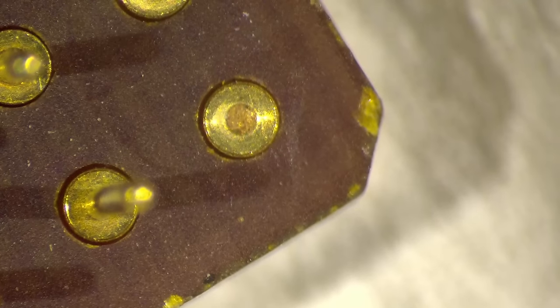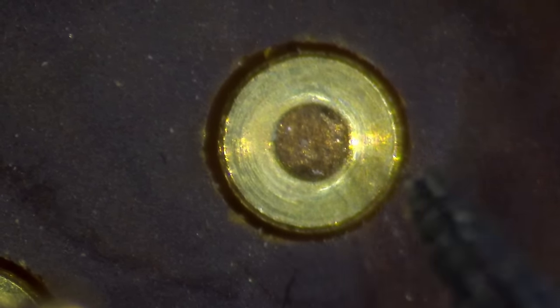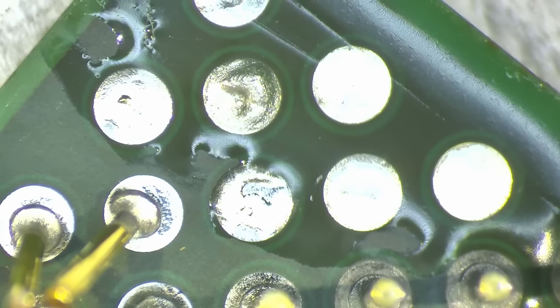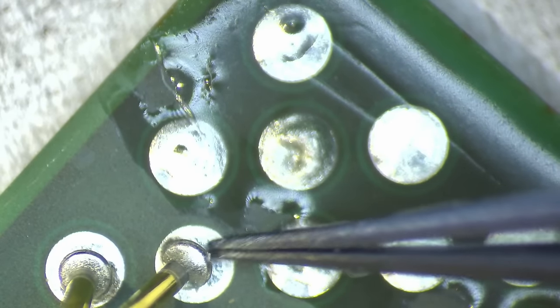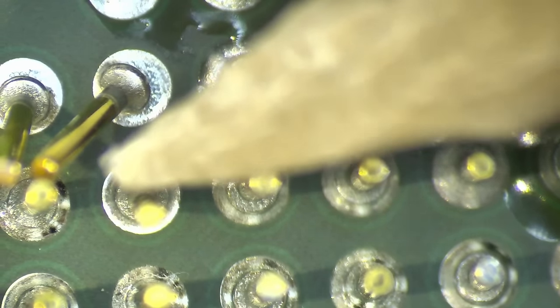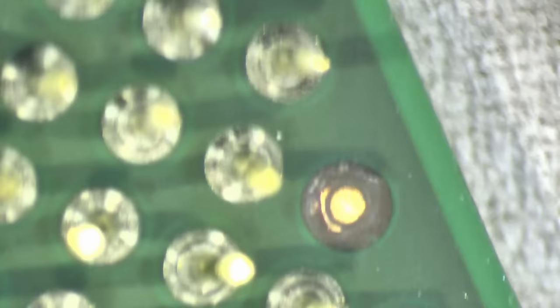We have these few pins in the corner, and as you can see here, this is a missing pin. However, the base and the pin look like they were machined out of one piece — there is no gap or solder joint. Here is a Pentium 3 for comparison where I already desoldered a few pins. As you can see, this pin is just sitting on top of a pad, but if you move one of these pins too strongly it may rip off the pad underneath, losing the connection to the die.